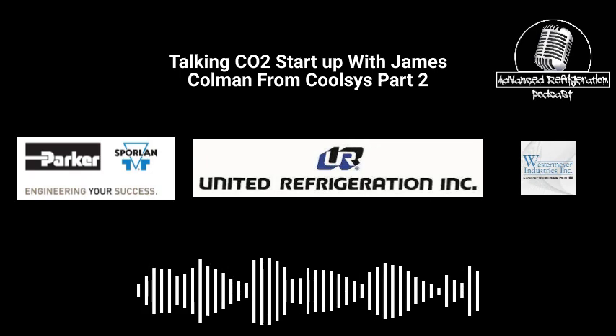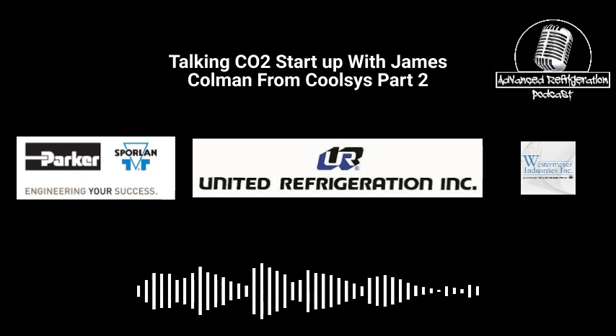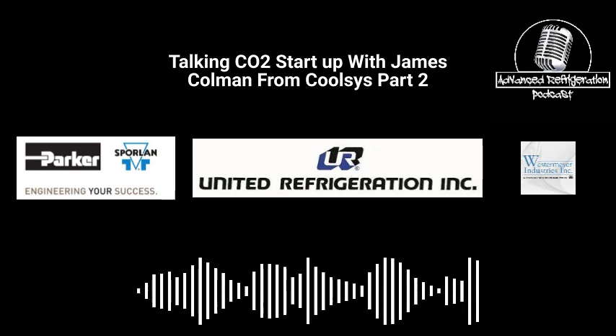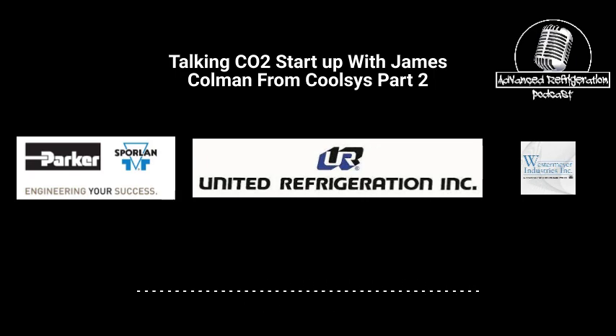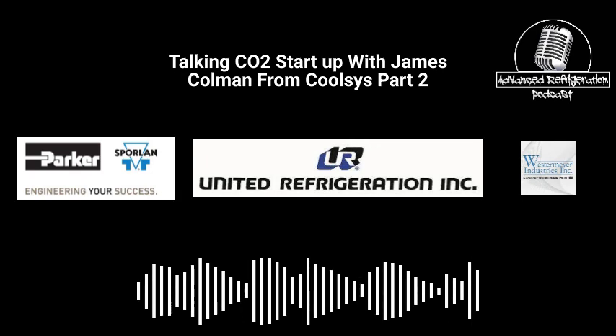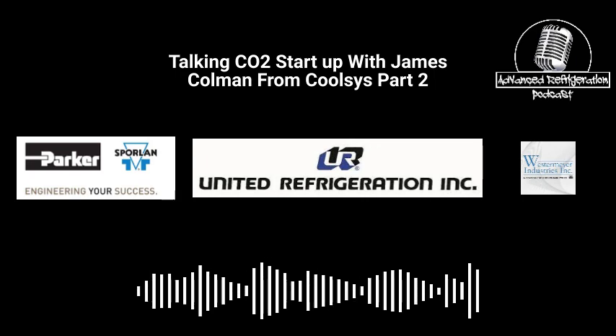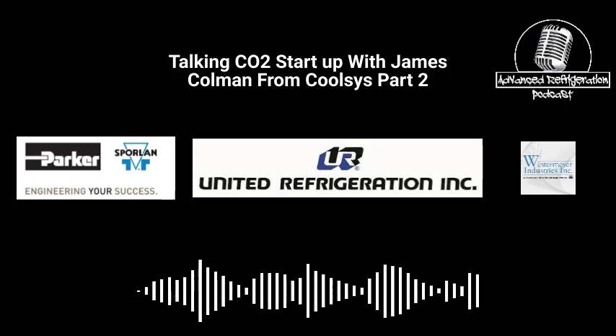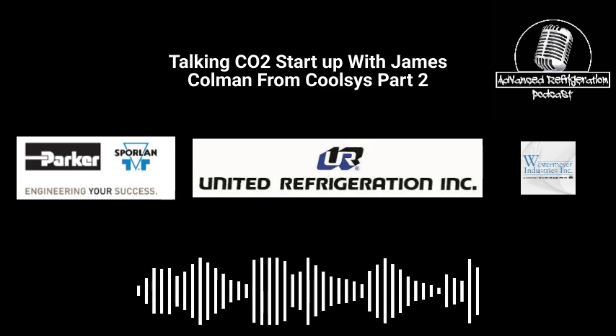Have you been seeing a lot of issues with pulse valves being wired wrong? A certain case manufacturer wires the pulse valve coil wires together, and then the hot and neutral together. So you fire up a lineup and boom - dead instantly. The case controllers fry. We just did a store and four of them died immediately when the electricians turned the power on. I've blown up so many pulse valve controllers that I check them all now - I keep spares on my truck. I find it at least one to two cases per store. It's got to be one person at the factory doing that.